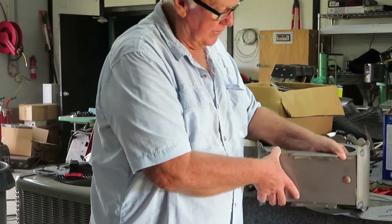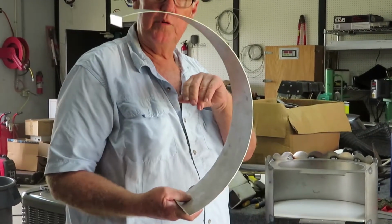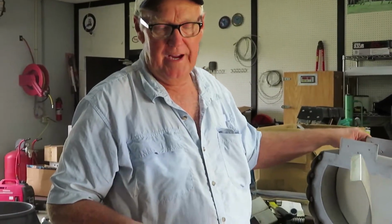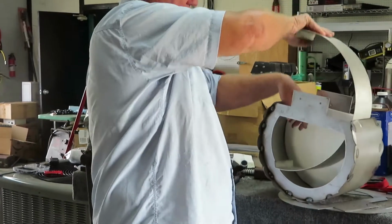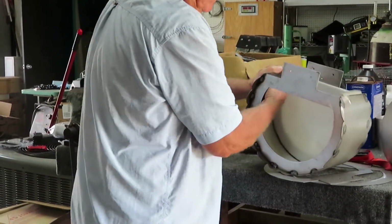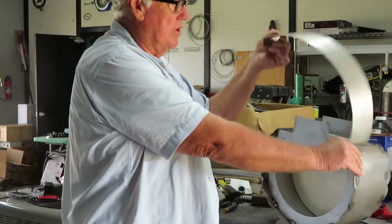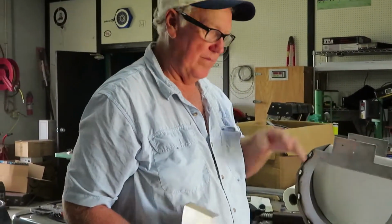Now the LEDs are a little different in the way we're going to attach them. I took a thin piece of aluminum, which will be painted also. It's going to have two strips of LED right here in the middle, attached. This is because we live in Florida, so we get a lot of mold and everything else that grows. After the LEDs are attached, it can be inserted in here. So it just gets put in and then rotated in here like that. So the LEDs would be right at the bottom then. When you need to clean it out, you just grab it by this flap I made and pull it out like this, and then you get all the electronics out. So all of the inside can be washed and cleaned easily. That's why I built it that way.